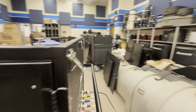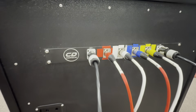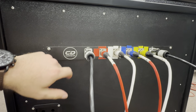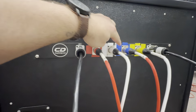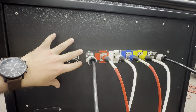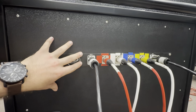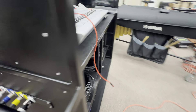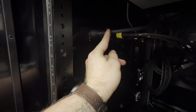Another thing I did for them was this quick-connect panel. By default, Core Design carts come with a blank panel, but I bought some PowerCon connectors and XLR pass-through connectors and basically installed a version of my active output panels using the built-in panel from Core Design. The power inlet is on the inside, you can see the heat shrink on the PowerCon cables, and all the audio cables going up to the mixer are color-coded.